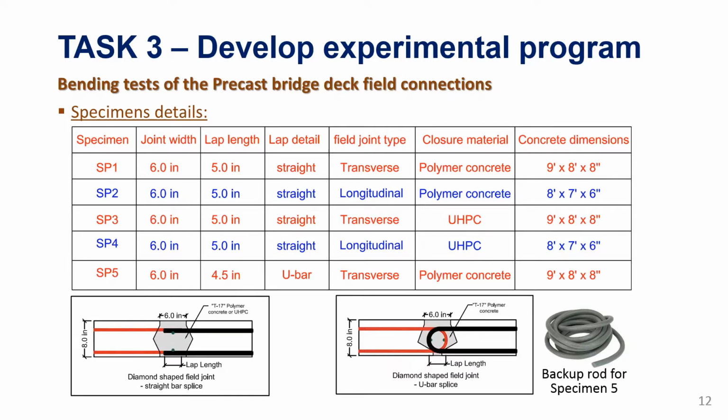So that's a very good question. For construction, we didn't really see a big difference, but maybe this was because it was a small-scale application. It only had 10 panels, and only 2 of them got the loop. So it wasn't really a lot of work anyway. I couldn't say something about the feasibility of the construction of these. But what I can say is that we talked about this type of specific connection with several DOTs, like Caltrans, for example, and they really prefer to see redundancy in these types of joints, because if anything happens and any slippage, one of the rebars is not sticking out to the right development length. At least this loop provides the redundancy when it brings the top and bottom rebars together. So it's safer, let's put it this way.